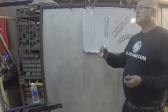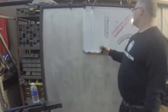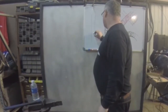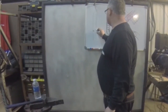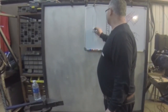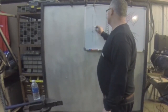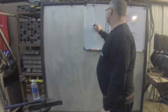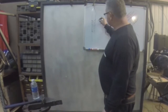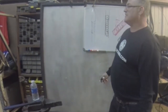You can't just turn the machine — maybe some high-tech machines pulse in a way that allows it, but let's stay old school. When I do a vertical up, I concentrate my heat left, right, left, right, and I never waste any time in the middle. If I don't keep my parallel lines and I'm stopping at all kinds of random spots, my weld's going to look like crap — trust me.